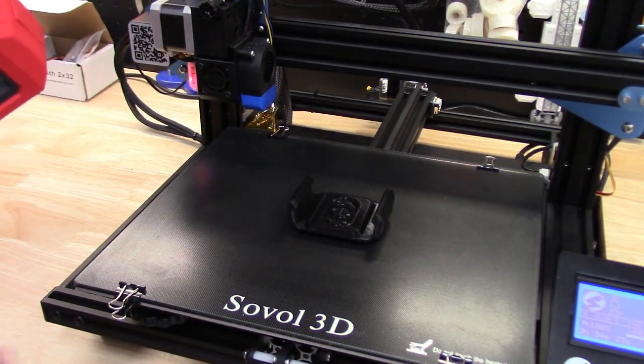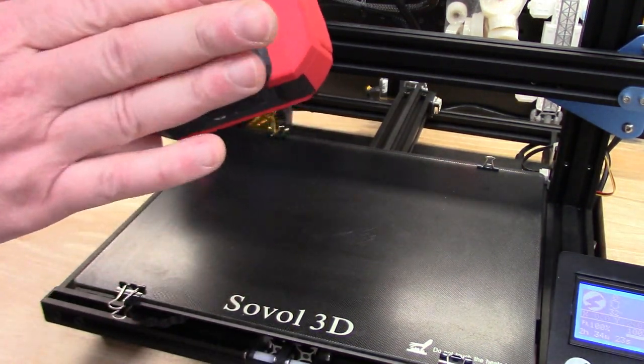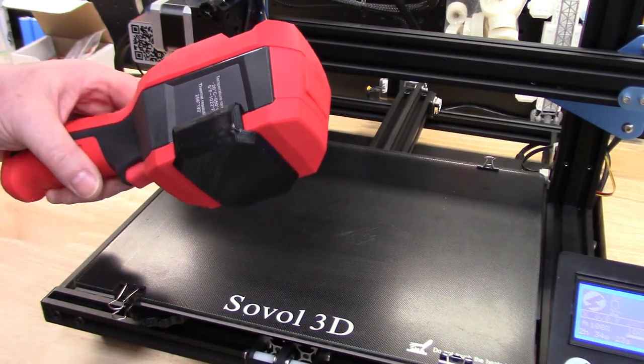Now the bed is set to 60°C and at the hottest point in the center it's at 61°C. Most importantly, that wire is no longer warm — I replaced that cheap PVC jacketed wire with some nice high-flex silicone, so I shouldn't run into that problem again.